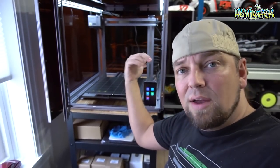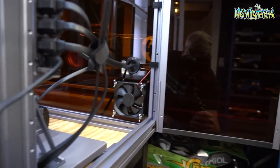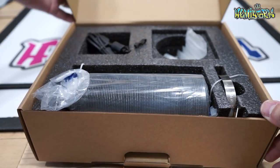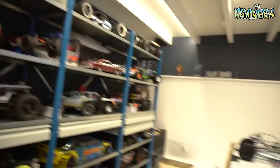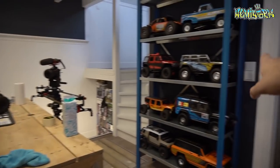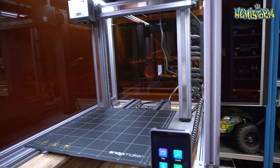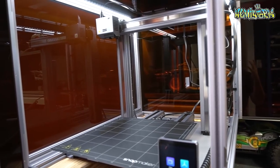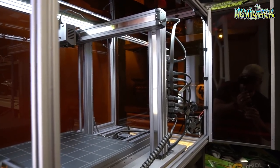Apart from it just looking totally sick, I also wanted this enclosure because it keeps odors out. You can imagine that if I start laser cutting or laser engraving stuff in here — whether that be fabric, wood, leather, acrylic, whatever — this place is gonna stink like hell, not just here but also upstairs in my office. So for that reason, there's a little fan in the back over here, really easy to set up with a hose clamp. You can connect the hose and just throw it out the window, or in the long run, run a duct or pipe system to the carpentry side of my workshop to expel any nasty or hazardous odors. Having this enclosure for me feels very safe and means I can get way more use out of this machine in its current location.